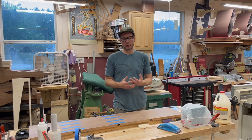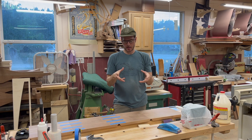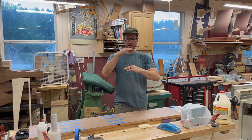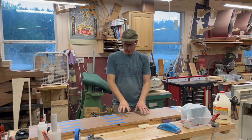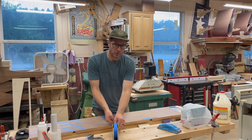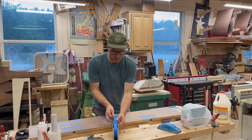Now it's time to tape this together and see how it all looks. I tilt it at 45, do my first couple of checks to make sure everything looks right, then I actually go ahead and cut a small box — all the corners — bring it together, make sure it looks perfect. I don't like to make a real big one first because of bow and things. I had to make a couple of little adjustments to make sure it was tight on the outside and inside, and once that was done it gave me the confidence to go ahead with this. One important thing: you need to make sure the off-cut is clear. A lot of times a piece will get twisted in there and just fly right out, so just make sure you're being cautious of that.